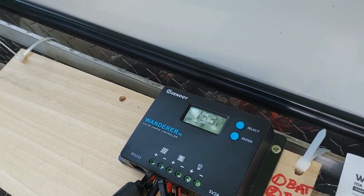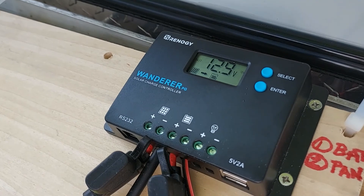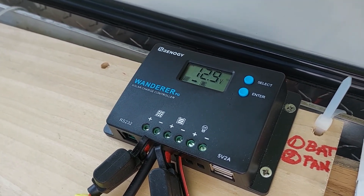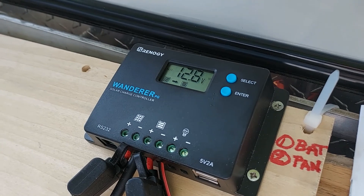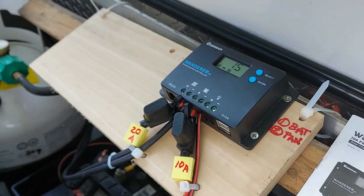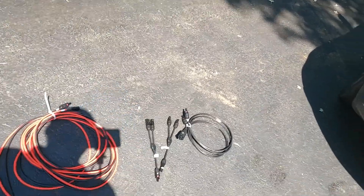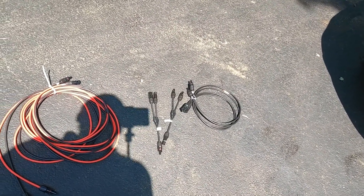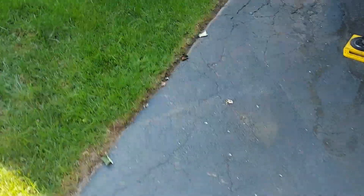There's your solar panel reading on the display. At the top there are select buttons to cycle through three or four screens, and the enter button is to change parameters. I have mine set up as a flooded battery — you can also choose sealed or gel. I'll put links in the description to YouTube channels that go through the settings in more detail. There's also a higher version that supports lithium. For extra cables: I bought a 20-foot cable, two Y-connectors to run two parallel panels, and a 5-foot cable.